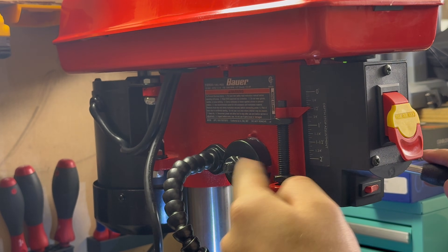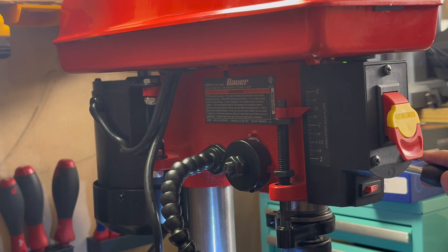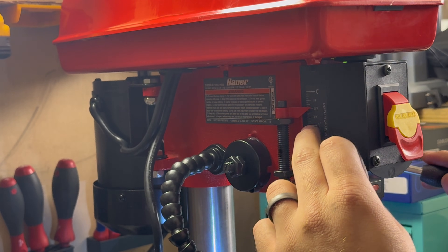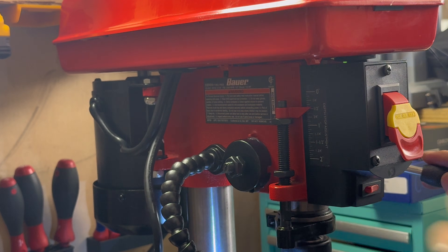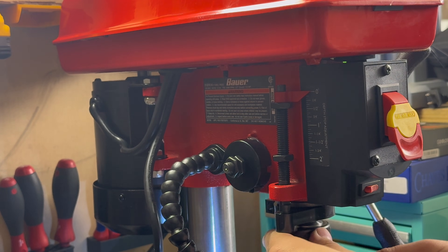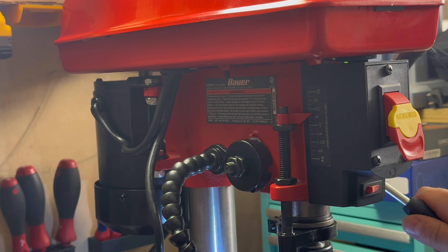So I'm going to take this out and use this nut here to limit it to only five-eighths of an inch — we have to go down an eighth from the half-inch mark. I'll take the end mill out. That's too much. That's about where I want it, so I'm going to limit it to right there.